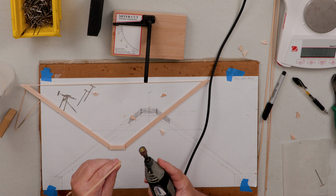Probably the optimal failure would be right around, well, obviously right around 15, but because we need to guarantee 15 kilograms for the bonus, you probably want to design these in the 16 to 17 kilogram range so you can test it ahead of time close to 15 kilograms, if not at 15 kilograms, so you can guarantee a maximum score during a test.